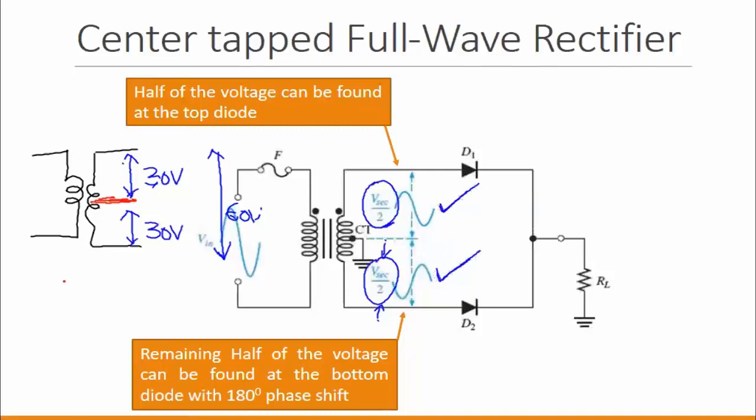Of course, for AC signals there is no such thing as a positive or negative magnitude. We only talk about their phase shifts. Of course, that implies one negative voltage. But if you remember, you don't really see negative voltage on an oscilloscope, correct? It shows you peak, peak to peak, or RMS. There is no voltage that you will see like negative 3 volts peak to peak. But it's our understanding that if you see a negative in front of an AC signal, the signal is inverted in its phase by 180 degrees. So that negative only indicates a phase inversion for AC signals. For DC, yes, signals could be negative or positive. But for AC, a negative in front only implies a phase inverted signal.